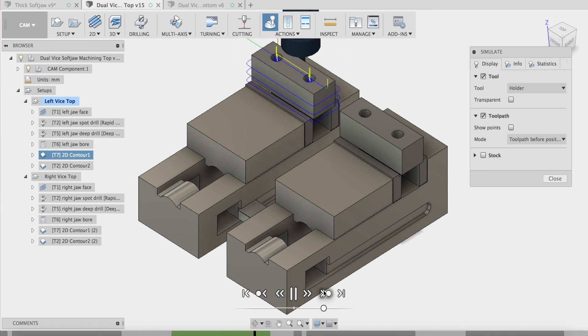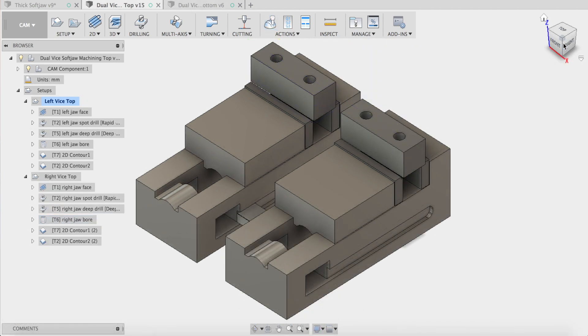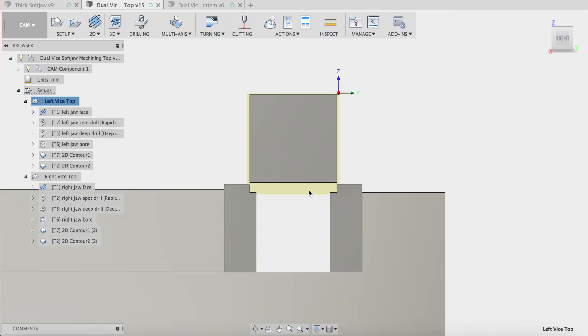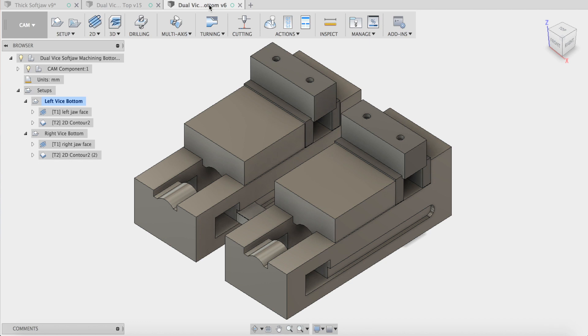The three passes get it looking nice and neat. The contour around the top just takes the sharp burr off, and the same thing happens on the other side. You'll see back here that I've actually offset these for the bottom stock, so you can see the bottom stock is accounted for, not the side offset though. From here I'll put them back in, flip them upside down, send them back into the hard jaws and simply face it.